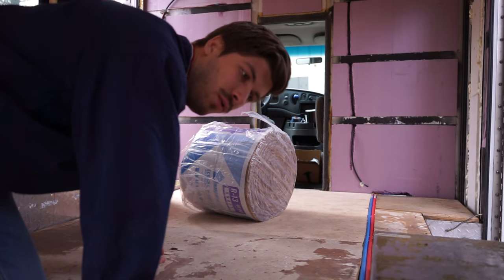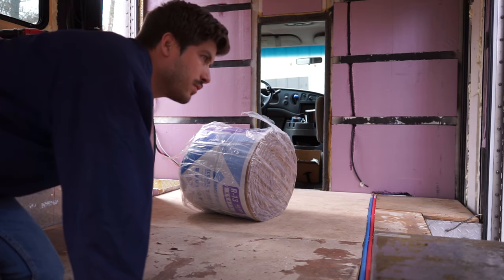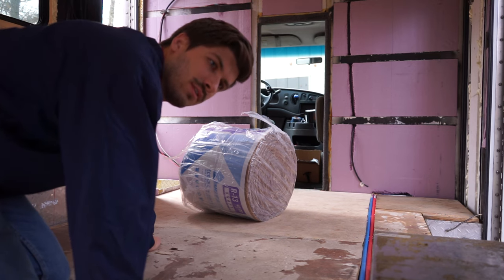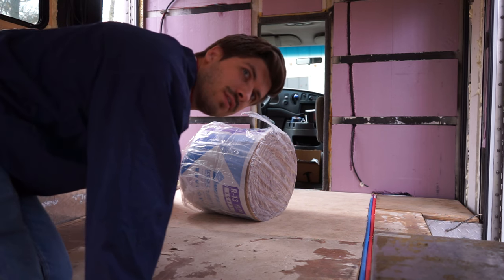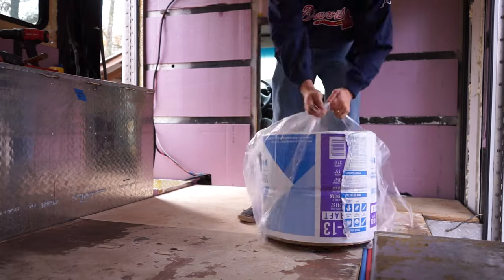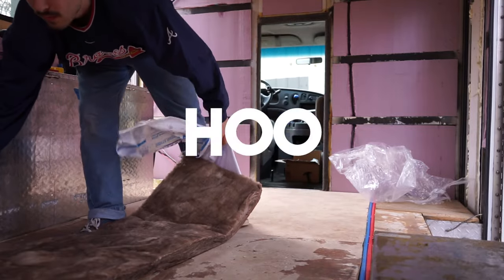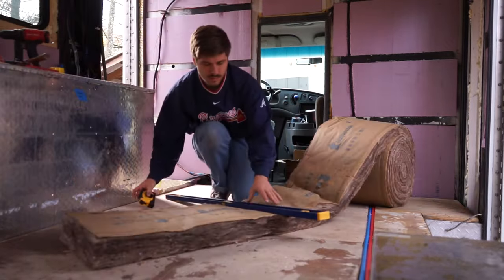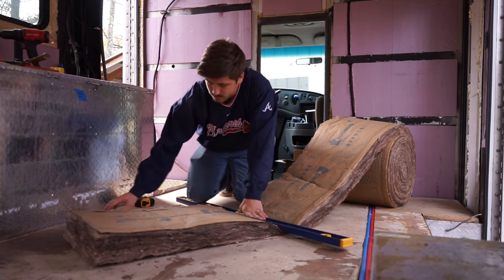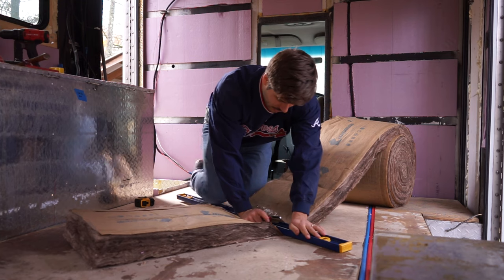I'm done with the rigid insulation, but now I've got to use spray foam for certain areas — like where the cables are a little too complicated to cut around — and then in some of the doors and crevices. So we're using a combo of insulation. We're going to do our best to be as warm and quiet as possible. This is the way to cut fat insulation: take a level, press it down as much as you can, and then raise the blade. It makes it a little bit easier to cut.